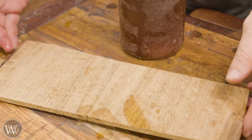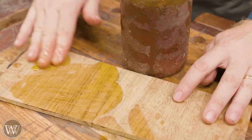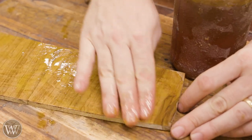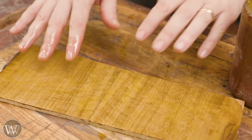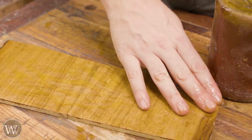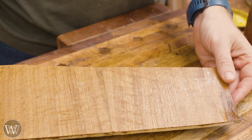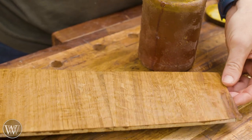This is a scrap of quarter-sawn oak, and this is where linseed oil really comes out — it brings out all the natural colors and textures in the wood and it just comes to life. Linseed oil does this in a way that no other finish really comes close to. I apply a fairly liberal coat all the way around and let it pool up on top, letting it sit for about 15 minutes so the oil soaks completely into the wood. I'll wait until the wood won't take any more, then put another coat on 15 minutes later. After three coats about 15 minutes apart, you can see that natural wood feel. That gloss will disappear as the oil fully polymerizes, which could take a day or more, turning into a much more flat finish when cured.